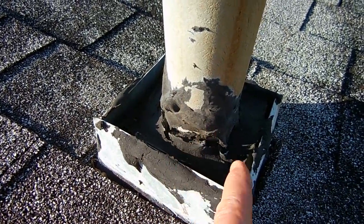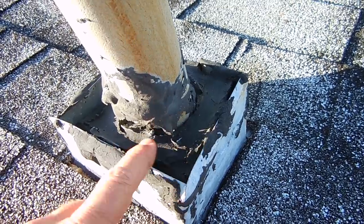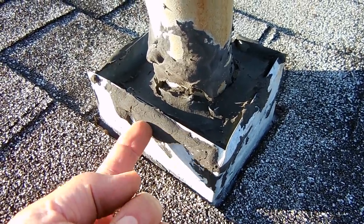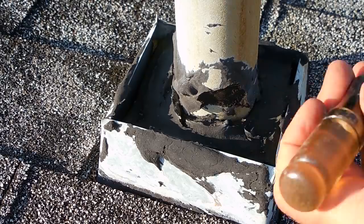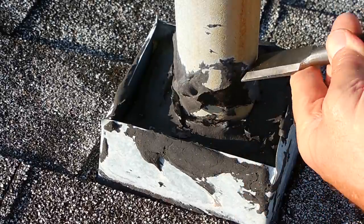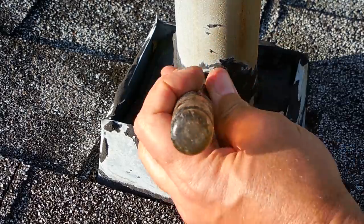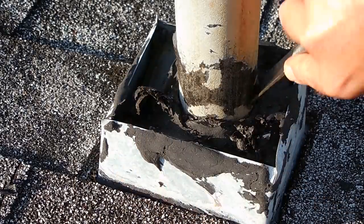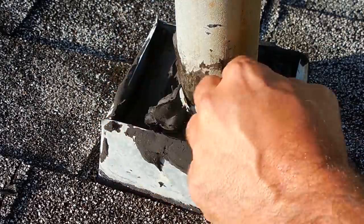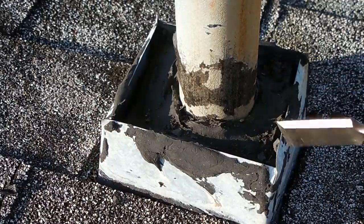I'm going to have to scrape all this clean all the way around, and I'm going to curve this in a little bit because I don't want it too high — when I fill this in and put mesh, I don't want water standing in here. So I'm more than likely going to bend this lower because this is pretty high off the roof. This is an older chisel and I don't need a brand new one. Just want to get this pipe nice and clean — two-inch rigid. This is all very hard; let me go all the way around.